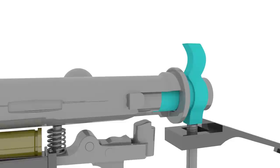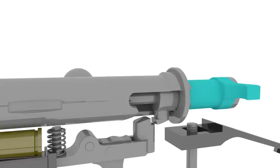This is the safety hook. Just pull, turn 90 degrees, and release. Now the cocking piece lug rests in a separate channel, preventing the firing pin from ever reaching the primer. To ready the arm again, just pull back on the hook and turn it the other way. Now the cocking piece is back on the sear and ready to drop.